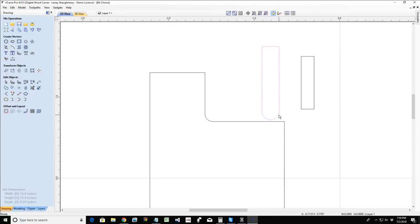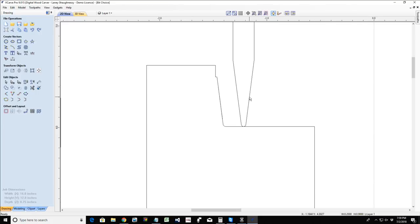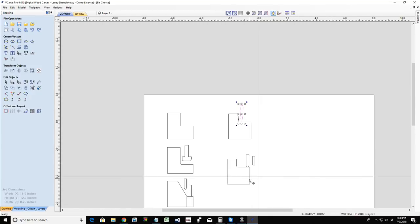Now, straight or tapered? Well, I only own one straight ball nose, an 1/8 inch straight ball nose. Most all of my ball noses are tapered bits because I want to be able to get into those deep hills and valleys and not have a lot of tool marks to clean up and sand away when I'm working. But it doesn't matter. Either or.